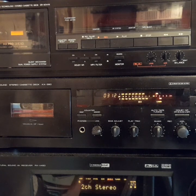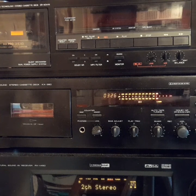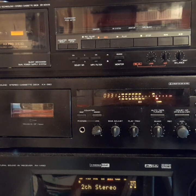We are now going to use a short musical example to allow you to set overall system balance using the balance control on your amplifier. The music has been recorded monophonically and should appear to come from a point midway between your two speakers from your normal listening position. Adjust the balance control until this condition has been achieved. If you have any trouble locating the central sound image, move on to the next part of this cassette, which will probably help solve the problem.